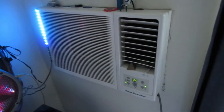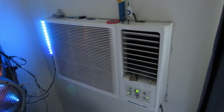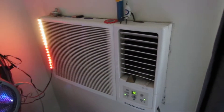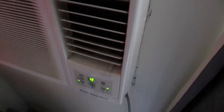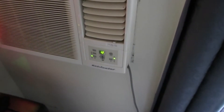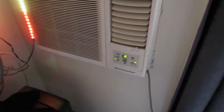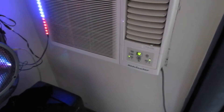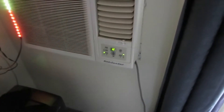So when it's cold, you want hot air to come down at your feet because hot air rises. So what you want to do is face your vents down. That's when it's cold — in cold weather and the air conditioner is putting out warmth. As you can see, it's 12 degrees Celsius which is pretty cold, but it's not freezing cold.